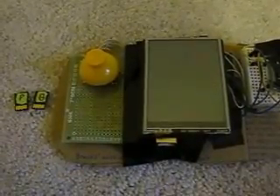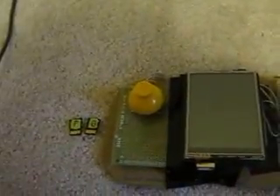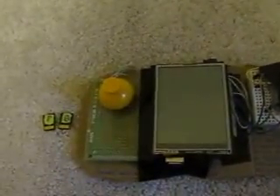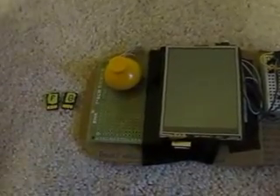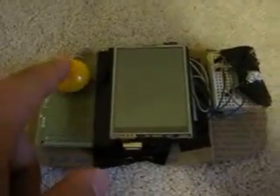For those who don't know, a short is basically two bytes. It's written in little-endian, which makes it a little confusing. Basically, if you write a short it writes the second byte before the first byte — so if it's 0x0146, it writes 4601 instead of 0146. That's little-endian. So I created a way to do it in C++ and I'll post that code as well. It makes it a little less confusing — you don't always have to use hex code. It's really simple but at the same time really complex.